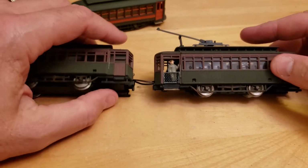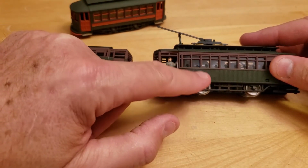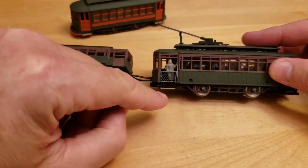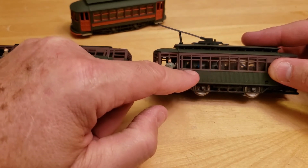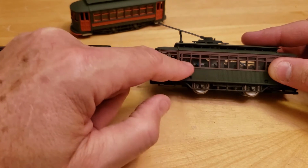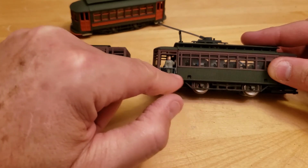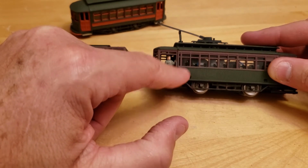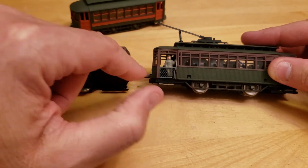But there's a few things I discovered when I took this apart to do the electrical connections. The motor is not the original motor, I figured out. It's actually got a blue wire holding it in place, kind of tied in place. It works, but it doesn't seem to be the original motor. They might have taken the old worm gear off the old motor and put it on the new motor to make it run. When I discovered all that, I found the chassis was put together incorrectly. There are two pieces to this, and the lower part of the trolley frame, which is connected to the chassis. When I corrected the connection between the two halves of the chassis, these are now both the same size.